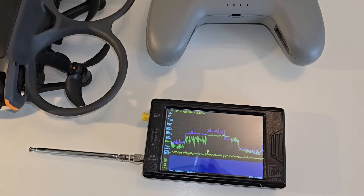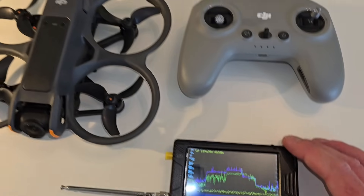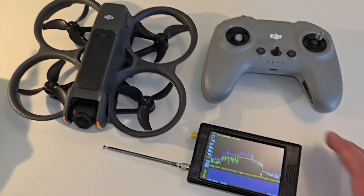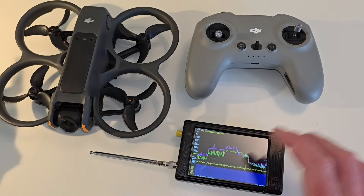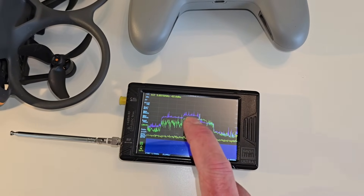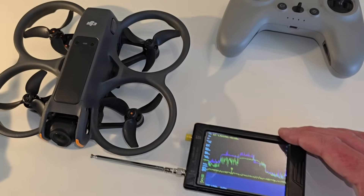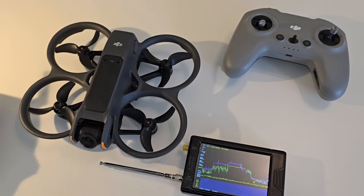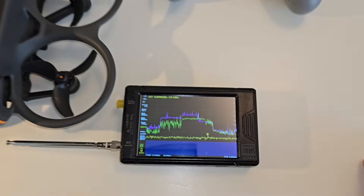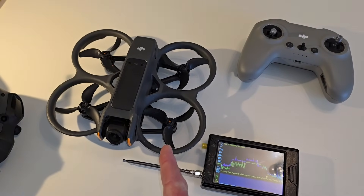I haven't really got any way of testing if this is 25 milliwatts. Going by the regulations, it should be 25 milliwatts. If we had something that was definitely kicking out 25 milliwatts, we could put that on here and see where it is in relation to these. You'd need a known source, or physically connect directly to the antenna with no loss. But if you look at the actual difference here, you've got a difference between minus 30 and minus 20 dB — which is 10, a factor of 10. So just by holding this around the outside of the antenna and comparing the two drones, it gives you a fairly good idea that one is putting out a hell of a lot more power than the other. Flying this in the field in a real live environment, this has insane range compared to anything I've flown at 25 milliwatts before.